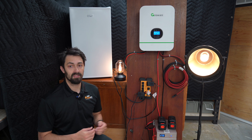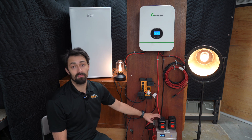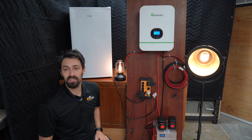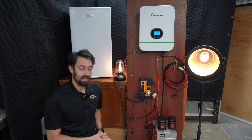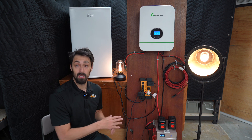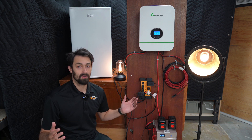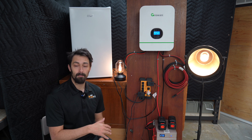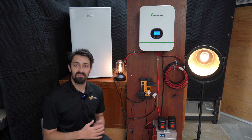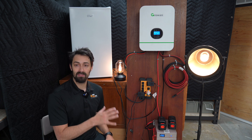I've gone around the office and collected a few things: two lights, charging two batteries — one for a cordless drill, one for a cordless saw — still powering the fridge the whole time, and we're taking roughly 80 watts. This battery can hold roughly 4,100 to 4,200 watt hours of power, which means this system can run everything here non-stop for over two full days before you'd need to charge it at all. We can also run a kettle, a microwave, bigger power tools, fans, shop vacs — a system like this is going to be able to power it all.